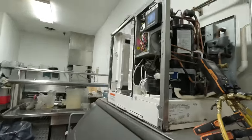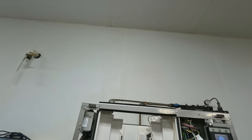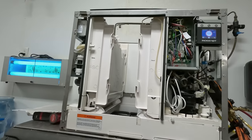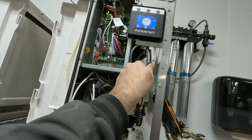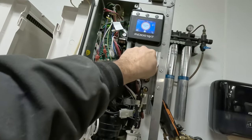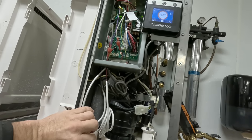The charge was a little low a while back. We did a leak search and couldn't find anything. They took the line set up through the wall so you can't tell if they made any connections in the wall — it's very possible that they did. So we're going to get this thing recovered. We've got to do a three-point evacuation on this because they do have solenoids and check valves in here, so we need to get around those to get all the refrigerant out.